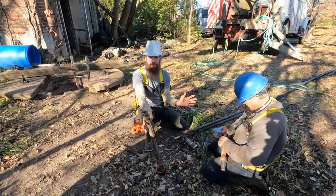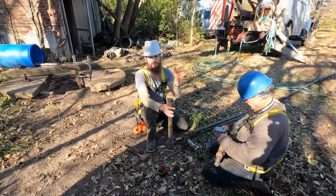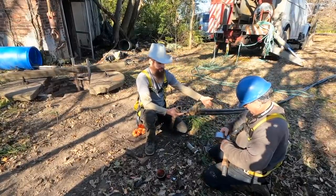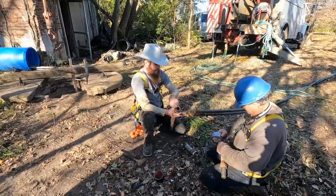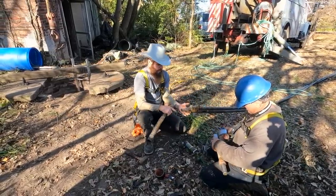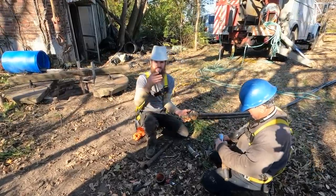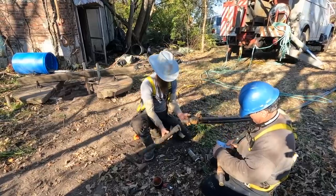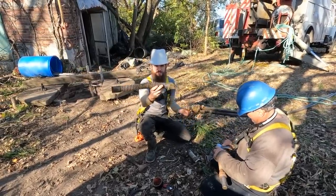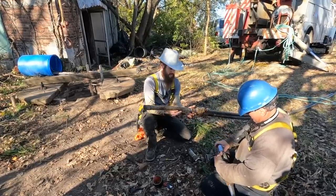So our foot valve fell off, which is right here. It has a check ball in it that keeps pressure so we don't lose prime. The ejector here, the pump pushes water pressure down through it and then allows it to build pressure to send more water up the larger pipe. The foot valve here was attached right here, but it wasn't deep enough to pump out the water that's down there. So we're using this flexi hose, Mortsky approved, because this is a use not for automotive, he'll love that. And we're gonna basically drop it down further.